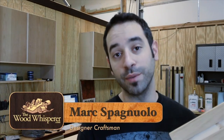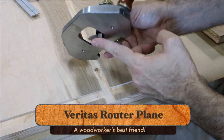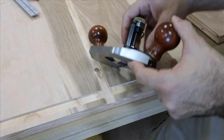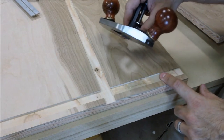I'm in the middle of making some shop cabinets and I thought it would be a good time to show you how I fine tune my dados. I actually use a hand tool to do it. This tool right here is a router plane, and it's called that because you can see how the blade sticks out from the bottom. You have this nice flat platform and you can use it to do a lot of the things that we use a powered router for. Since this is a fixed distance from the base, it's great for cleaning up dados that we've made on a machine.